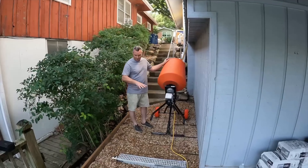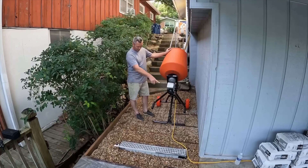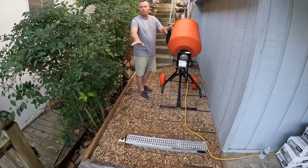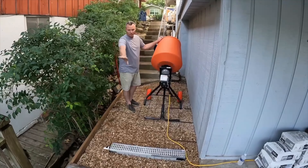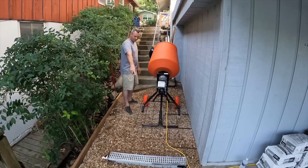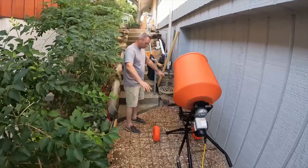For the concrete slab here, we're tying it to the house with some rebar. We're going to put in a drain here to keep water from underneath the deck, because before it was washing all the dirt underneath away. We're going to funnel all the water that comes down this hill out and away through that drain, and then clean all this up for the slab.